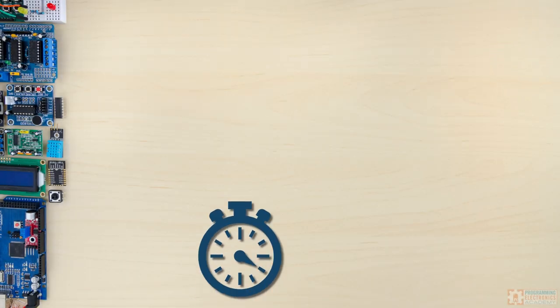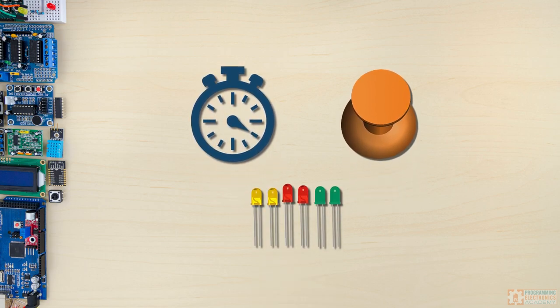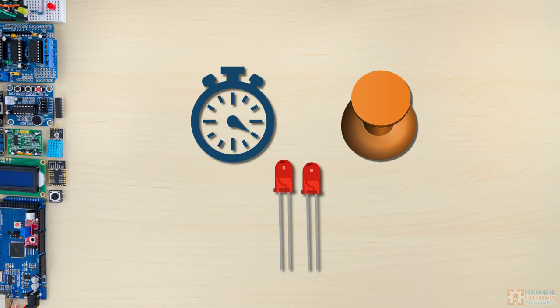So what I want to build is a simple timer with a button. I don't want it to be super intrusive, so I don't want it to make any noises. I just wanted it to have some LEDs that change color through a spectrum of color over the course of a turn. You'd be able to set the length of each turn with the timer. I'm thinking there's going to be a single button — it will have a set time mode, and then once you've set the time, it goes into play mode. The LEDs will change from green, go through a spectrum of colors, end up at red, and then when the turn is over, it starts blinking red. That's kind of what I have in mind.